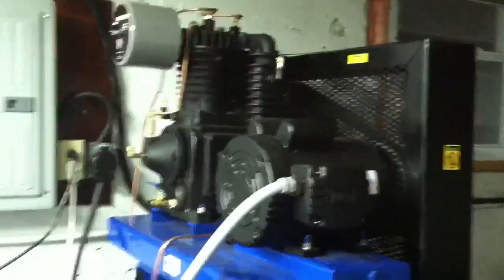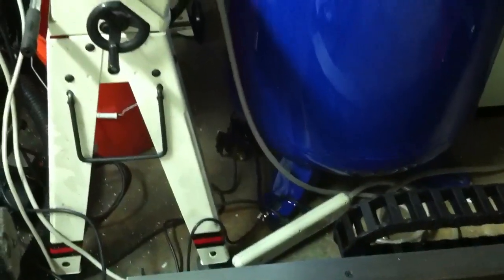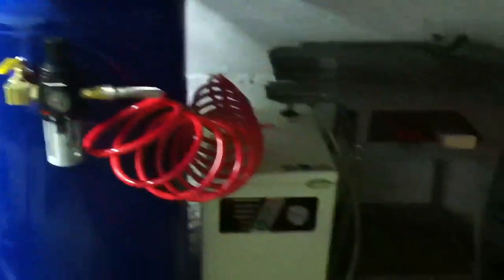I'm going to turn it off for now. The other thing the compressor has is an electronic automatic purge valve down here, which is great for keeping your tank drained. Ideally I'd like to plumb the air dryer in between the compressor and the tank so the only air going into the tank has already been dried, but I haven't figured that out yet. Right now the air dryer is plumbed after the tank — it leaves the tank, hits the air dryer, then goes over to my equipment. The purge valve is pretty loud when it fires. It's electronic and has two little knobs on the front to adjust the interval — every 15 minutes, half hour, or hour — and how long it should purge for each time.